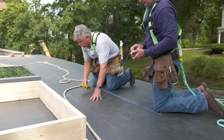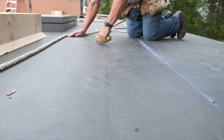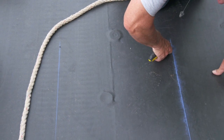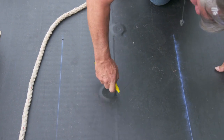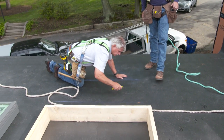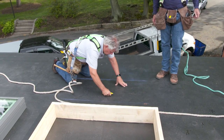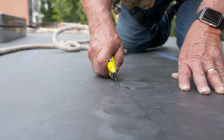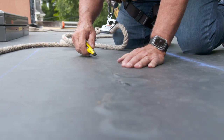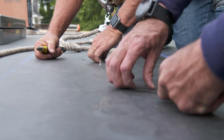Now what I'm going to do is cut from the hole following this line at about 45 degrees and cut in to the center. So this is that rubber roof that we installed. Now we'll cut the other one out. Now we'll cut the other two. Connect it down the middle. Now what we're going to try to do is pick this up. I know it's stuck down with the glue, but we've got to be able to roll it back and up. It's always tricky. This cement really holds well.